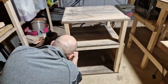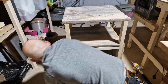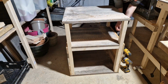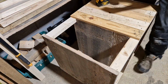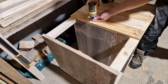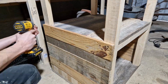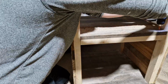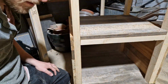After forgetting that batten needed to be 25mm below the level of the pallet wood, I just had to readjust it. I forgot that the board was going to sit on top, but never mind that. Once it was in the right spot, I basically just battered the hell out of everything with a hammer. Once this had been gently nestled in place, I went through and put a screw everywhere where a screw would fit. I screwed it to the batten, I screwed through the pallet board into the side of the plywood, and afterwards it was structurally sound. It certainly wasn't going to come apart again.